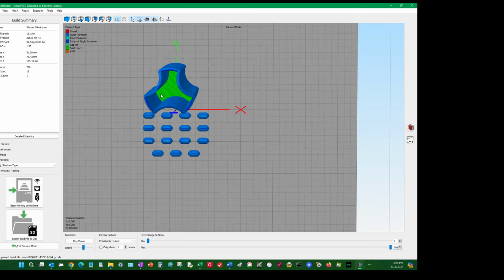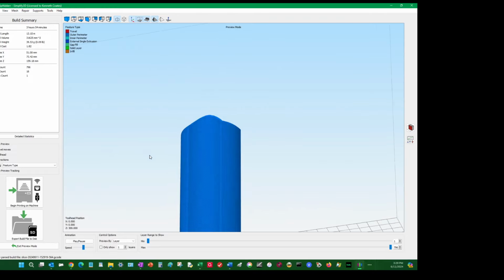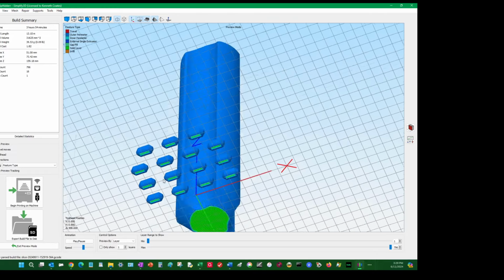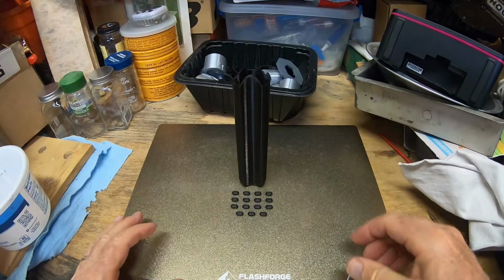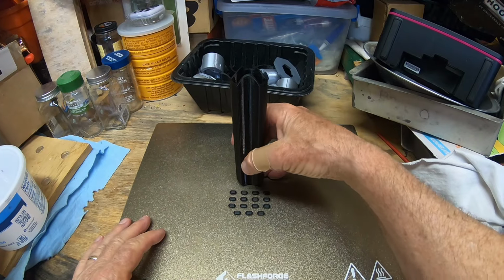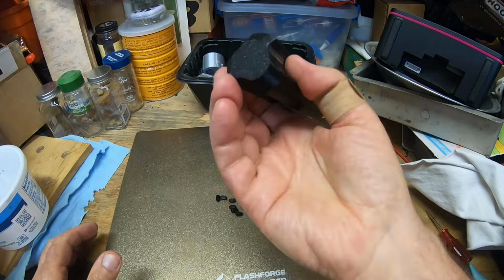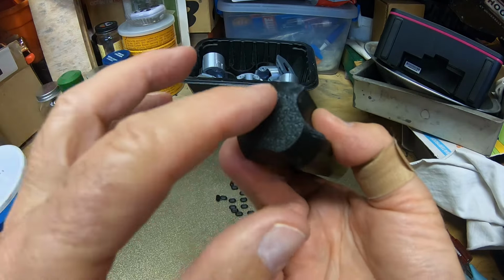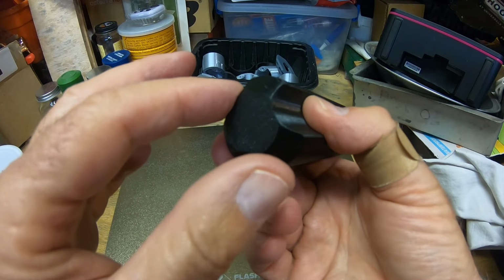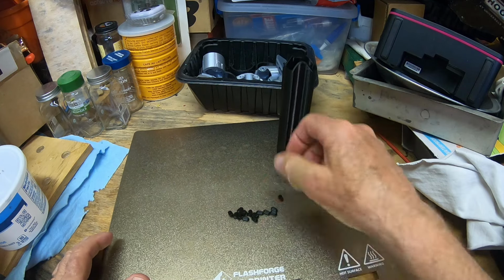So you made a nice spline here because it's empty inside. So there's no reason to fill this because it's just acting as a thing to keep things from jostling around. So, all right, this is another small surface area print. Very tall. That's tricky. But the PEI came through again, so you can see this is a pretty small area. So again, you could print a raft. If I was worried about it tipping over, I'd print a raft. But with PEI, I don't really have any problems.